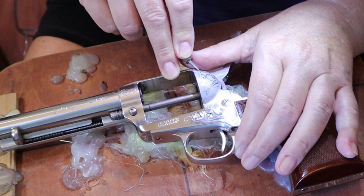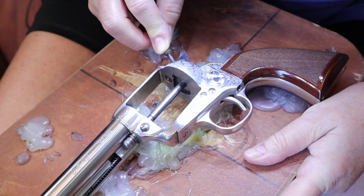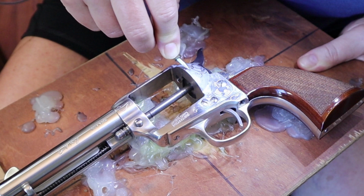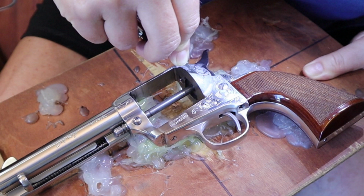Cutting the ball part of the frame is quite difficult because there are so many different factors moving and you've got a lot of things going. I'm using the pedal on the floor to supply air to the graver. It moves the little hammer inside the graver, so I don't have to use my hammer physically outside like you saw me with the dot punch. There's a little hammer inside there that is powered by the compressed air, and I'm operating that with my foot. So that is where you hear it speeds up. I'm giving it more air, and the hammer goes faster. So I'm dealing with that.